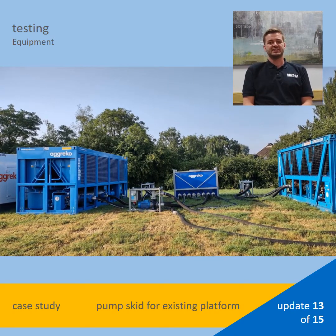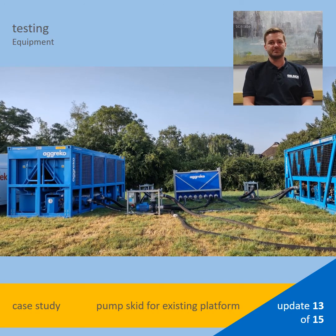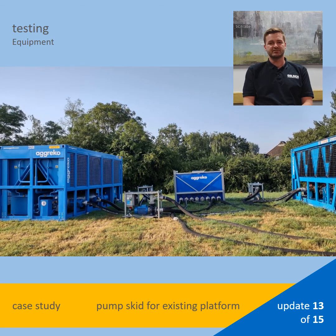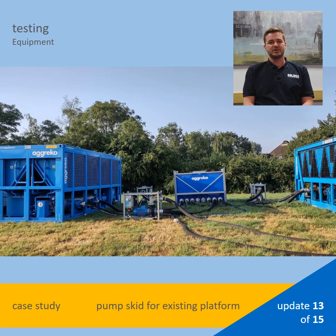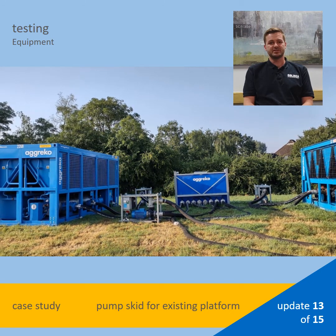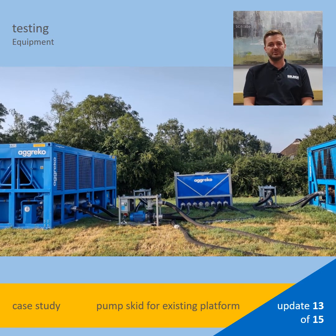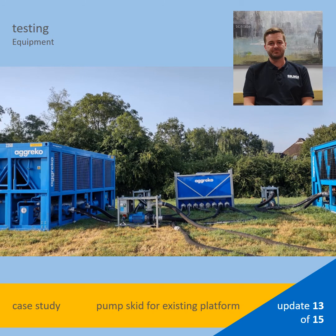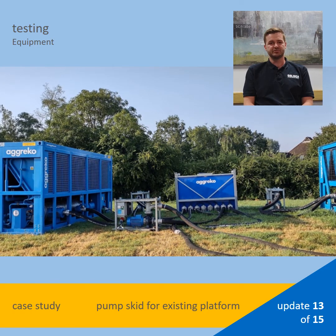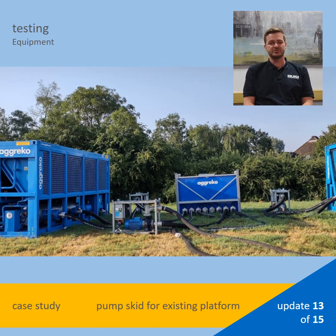The chiller unit performs two tasks. The fluid we use for testing is water which is recirculated into an atmospheric tank. Energy is put into the water by the pump and results in the water temperature returning to the tank increasing. At this power level, the water would heat up very quickly and boil. The chillers keep the water in the tank below the design temperature of the system. For ATEX testing, the temperature of the pump is monitored at multiple locations. Temperature stabilisation is required so that maximum surface temperature under normal operating conditions is proven. To enable this, the chiller unit has a control system which maintains a constant water temperature.